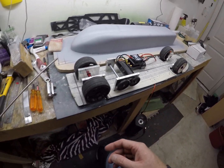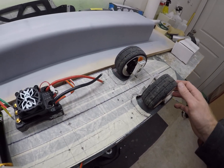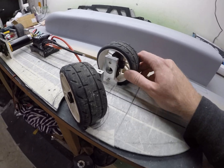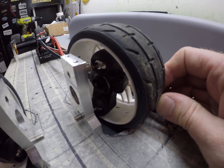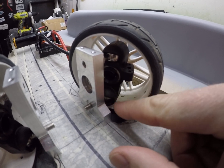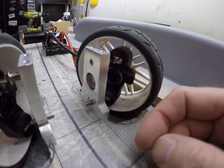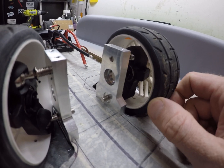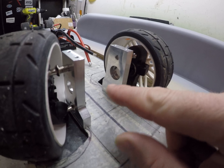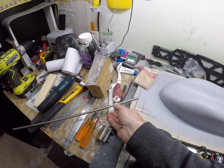As far as the front, it's going to be sort of like a dog bone setup. Previously in some videos I hadn't been showing it, but I said screw it — I want people to build things and make things, so here it is. These are Arma 6s knuckles, and the lighting is not great here, but the axle stub is a rear axle stub, so it's not a CVD like you'd normally have on the front. The way that'll work is just like a dog bone — I'll have an eight millimeter shaft through here with a pin going through it.